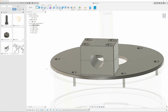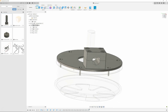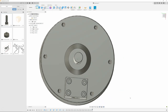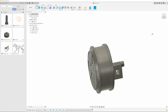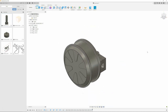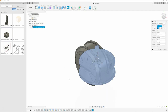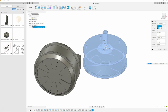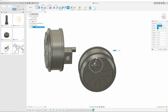That's why I always have calipers on my desk. When I have a bolt close to a corner, I try to make the fillet of that corner be concentric with the bolt - maybe just an aesthetics thing. I was worried about the stress of the bolts being too close to the wall of this. I was worried that if there's some tension, I'd immediately break the plastic. This looks beautiful. I didn't do the inside of the motor obviously - I didn't think I really had to. It would make your model extremely heavy and slow down your software.